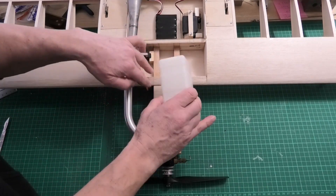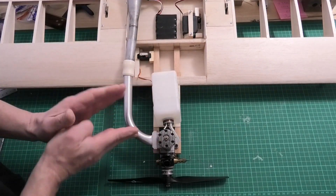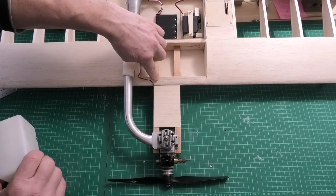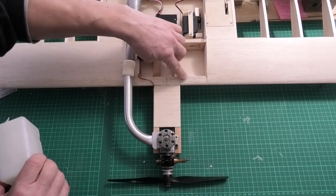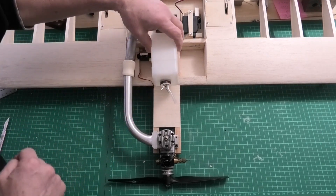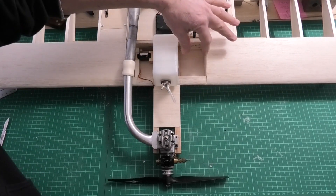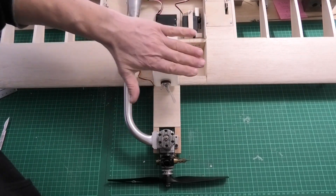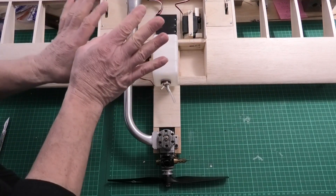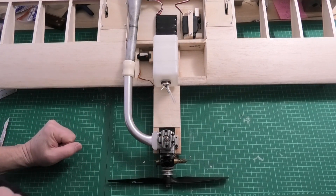The tank was going to sit where the plans show, but there's not enough room now we've moved the engine back. So what I'm going to do is shave off a little bit of this leading edge — I don't want to take off too much because that's kind of integral for strength — but I'm going to take off a little bit, put a little bit of balsa on the back and sit the tank there. Then I'm going to have to build up this centre section with ribs and sheeting with access covers. This seems to balance out pretty nicely.